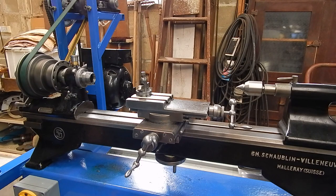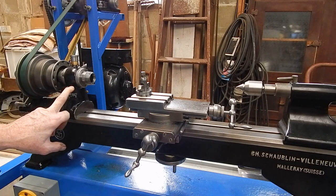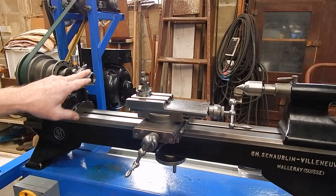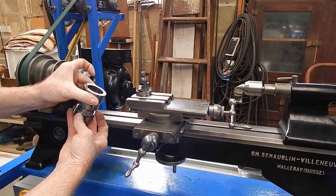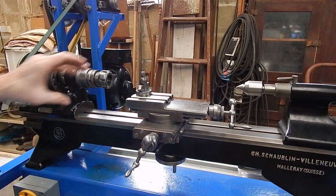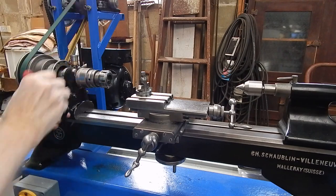I'll keep looking for a good chuck, but unless you get a really good old quality English chuck in good condition, which is going to be scarce, you're going to be waiting a long time. I thought, what can I do to get around this metric issue? I have got an ER32 collet system that I use on the little Chinese lathe and it works fantastically well — I'm a big fan of the ER collet system. So I thought, why not make up an adapter to go on the nose of the lathe to take ER32 collets? Basically, that's what I did. I knocked up this threaded cap to go on the spindle and you're good to go.